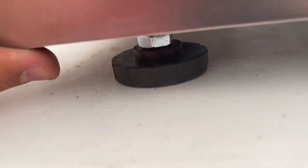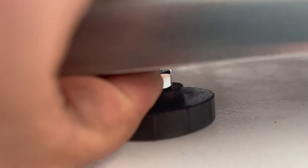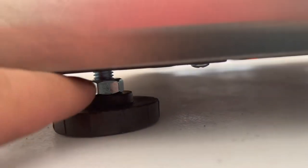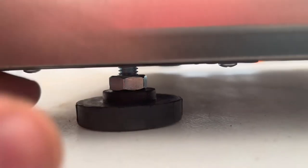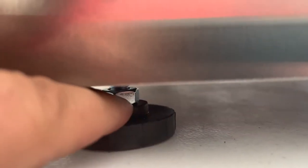These legs — let me pull one out — they do have a stop nut on there and you don't want to screw these all the way in. The end of the bolt — the weight will cause problems with accuracy. You'll want to unthread this bolt just a little bit so they're just for leveling — don't max them out or you'll be bottoming out the scale and getting a false reading.